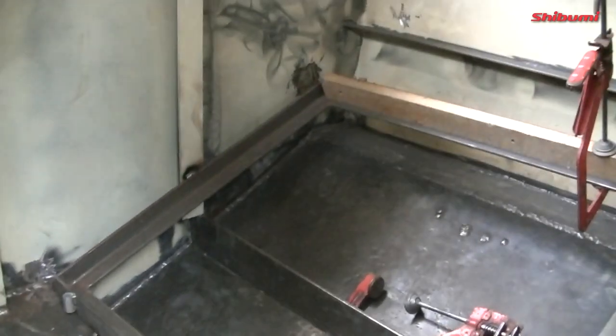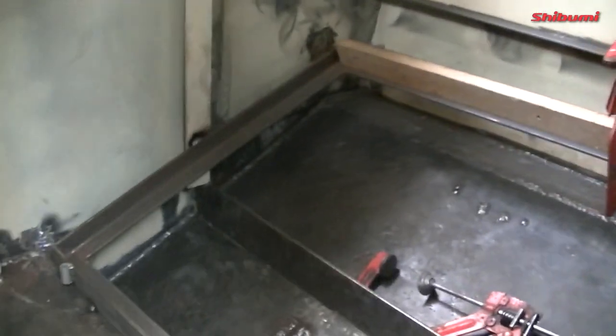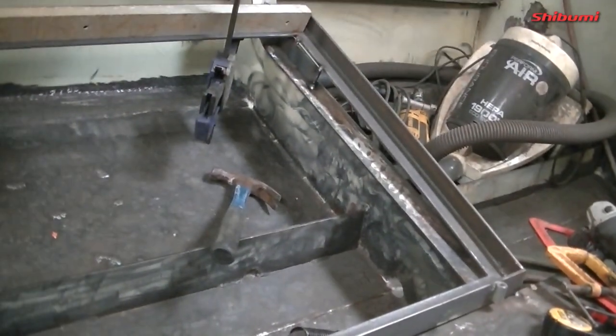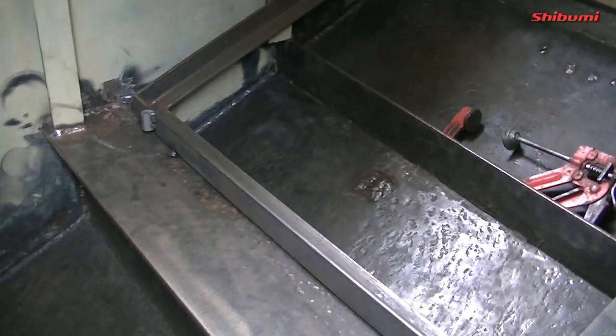For some reason, she shifted again from all the painting, with opening and closing the stands that the boat is standing on. So I'm ready now. There's enough weld on them just to hold it, a little tack there as well, and just one or two across the bottom. Then I'll lower the tank in and test it on a bit of cardboard, because remember there's going to be foam rubber in there, squeezy rubber, to keep them quiet and give them a good seating. I'm going to drop the tanks in now once I get a bit of help with the chain block.